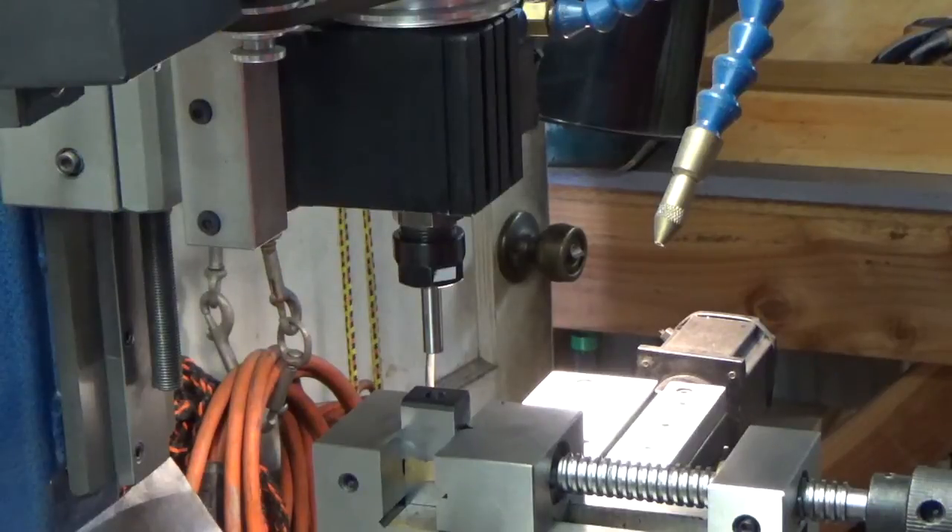The guide slot in the middle of the vice is big enough to drop the clapper right down into, all the way to the table, so I can get a pretty good bite on it. The hole in the end of the clapper is 5/16, so I took a piece of 5/16 steel HSS and dropped it into the hole to align it.